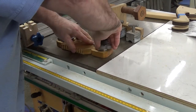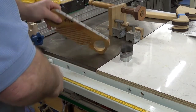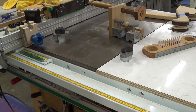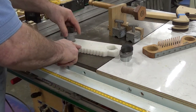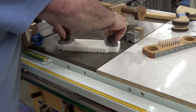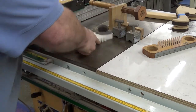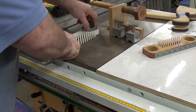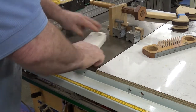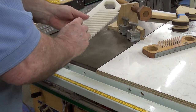I used to make wooden feather boards, but just one or two too many drops and they break. I had to brace them, and while the magnets will stick to them, they're not that great anymore. So I now 3D print my feather boards. The beauty of these 3D printed feather boards with the mag switch is that you can have them running one way, and if you want to reverse the direction, you just flip it over — goes that way or that way. Quite versatile, and it doesn't matter which side you put it on.